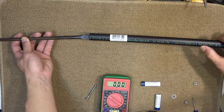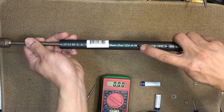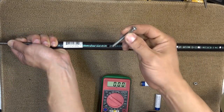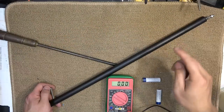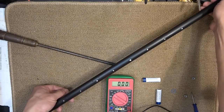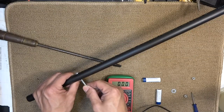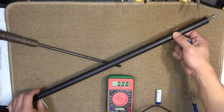I'm gonna use a long screw to push it in. You can see the top part of the battery right there — each hole is at the top of the battery. I can push it down and insert the screw in, so that will retain the battery in place. I can pull the spring on this end to release the tension, and now I can push the screw through all the way in. I'm gonna spin it until it reaches the flat end of the screw, so that the flat end touches the top part of the top battery. Now we have nine batteries in series.